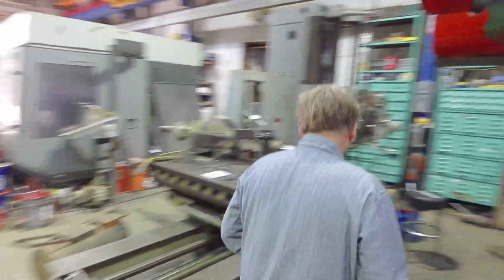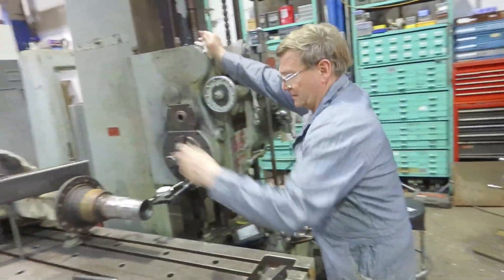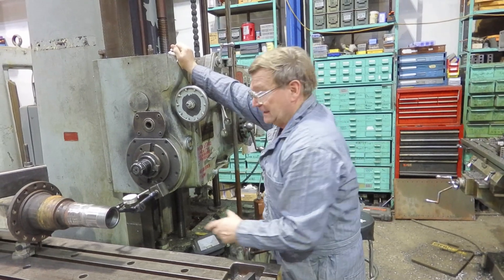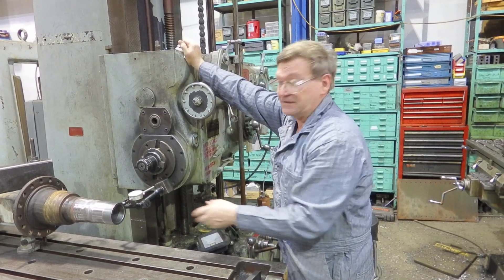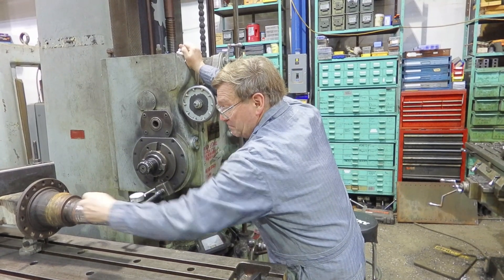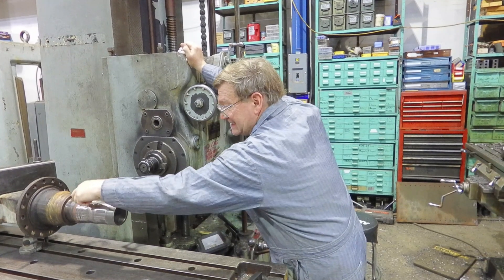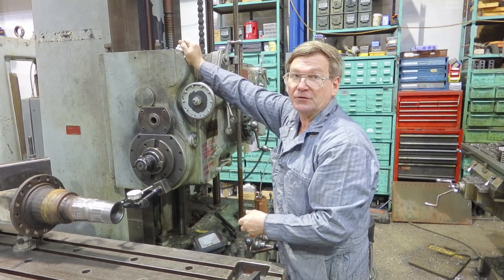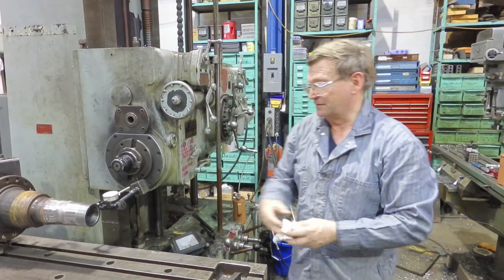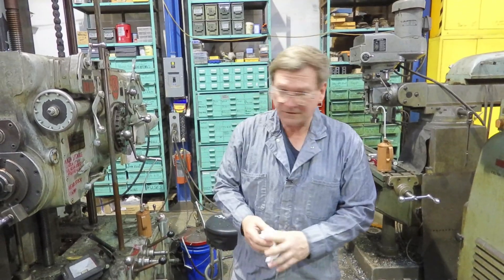When I do these, I don't just take a piece of tubing and weld it on. That's why the steady rest — sometimes it'll be a solid piece and I'll put it on the steady rest and actually drill it out. I'll do an undercut on the piece I'm welding on. This time it was thick-wall tubing so I had a little bit to bore out, but most of the middle was already gone. I make the portion smaller so it goes inside the rest of the tube, ensuring full penetration weld all the way down inside where you're welding it. Then there's no problem with strength — you're just cleaning up the middle again so the axle fits correctly. You put that on your steady rest and do your inside work first.